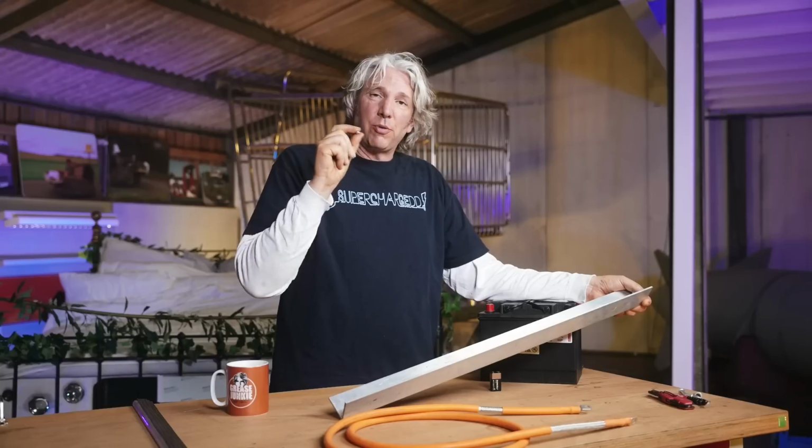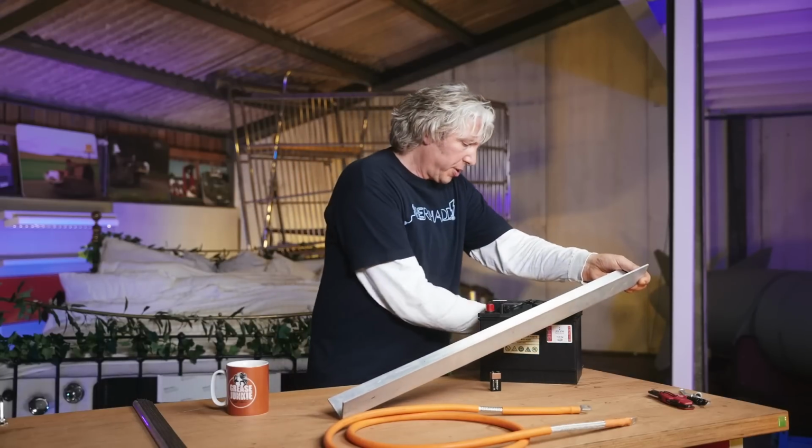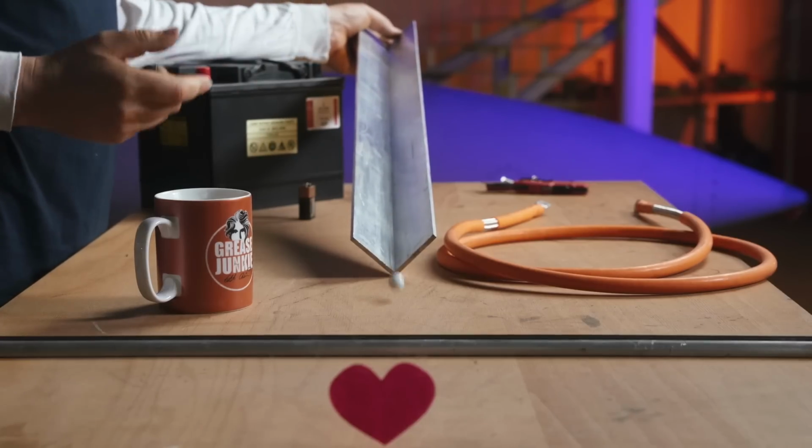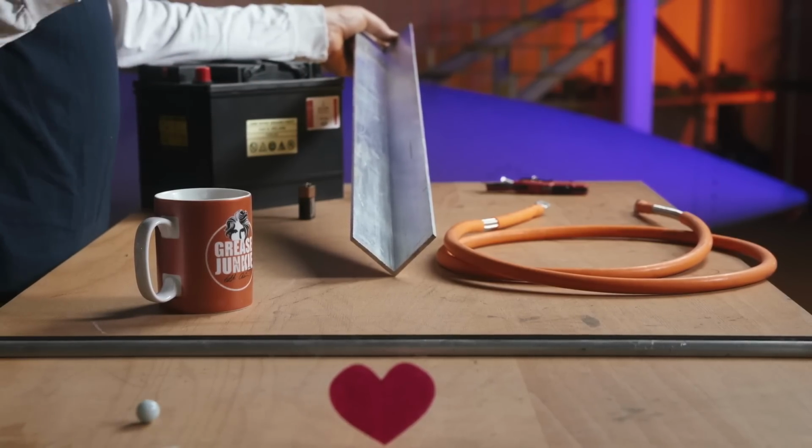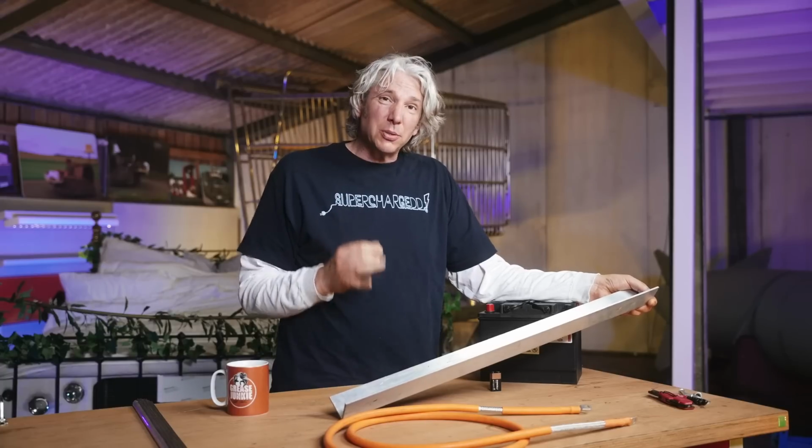Right, if we get rid of that, so now we know that at 60 volts, current can flow into your body, but at least at 10 milliamps, it's not really going to do you any harm. So if I get a bigger marble, for example, at 20 milliamps, then obviously it's still going to get through into your body, but at 20 milliamps, you're going to get painful shock, but you're not going to get any muscle spasms.